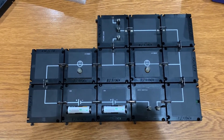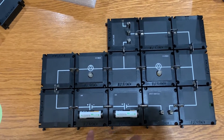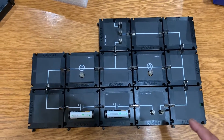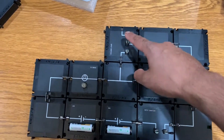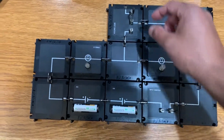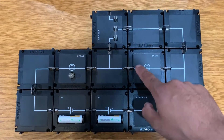One of the nice things about modular circuits is that students can come up with their own ways to put a circuit together. In this example, I'm trying to show two bulbs in series but with the option of bypassing one bulb. I have two pads and a switch — if I leave the switch open, the power goes through this loop. If I close the switch, the electricity will go through the path of least resistance and bypass that bulb.